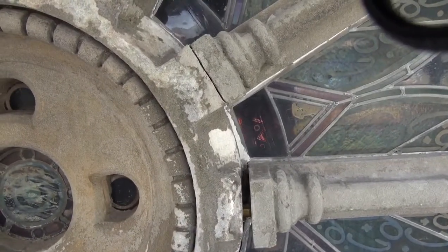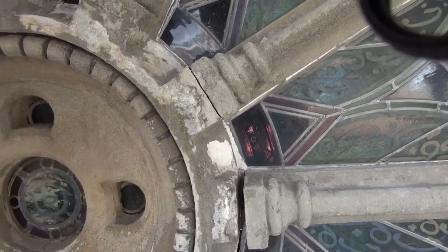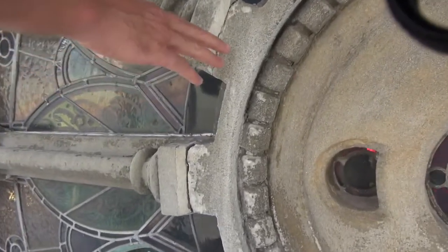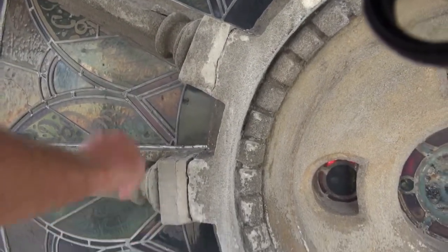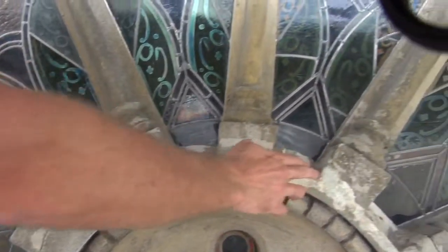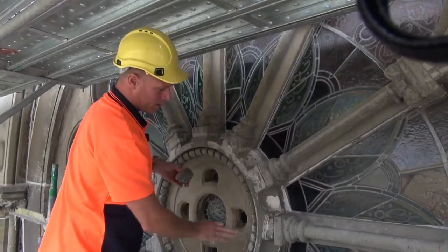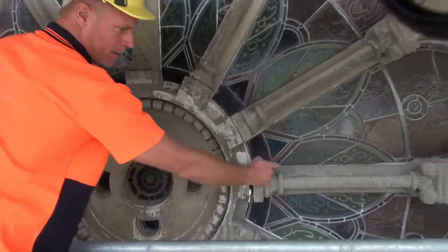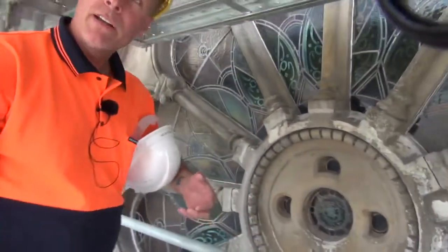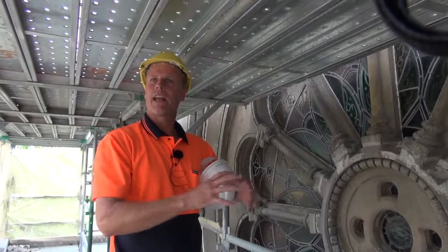What we are looking at doing is rectifying and stabilising — putting stainless steel pins, grouting them and locking them back in place to the centre hub. Over here we've got the 8, 9 and 10 o'clock spoke with the same issue, because they're the horizontal ones. The vertical ones at the top and the three at the bottom, because they're vertically loaded, have not moved. We're proposing putting a pin through the centre hub that'll go at least 100 millimetres into the spoke to join it together and lock it in place. We're not trying to bring it back together — we're trying to isolate any further movement.